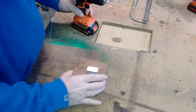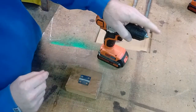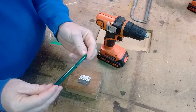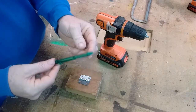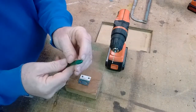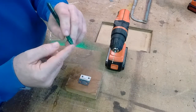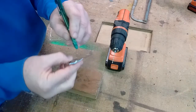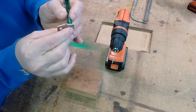So what I'm going to do here is — this is one of the hinges I'm going to be using, and this is the drill bit I'll be using. What I did is I took a regular writing pen and took all the guts out of it. Sometimes depending on how the end is, if it's really pointy, I just sand off the end a little bit. You just want to make it so that it fits in there without any slop and it's flush with the bottom.